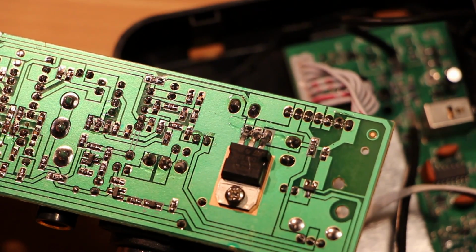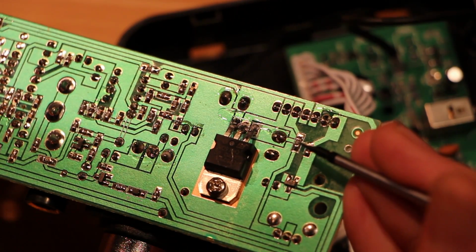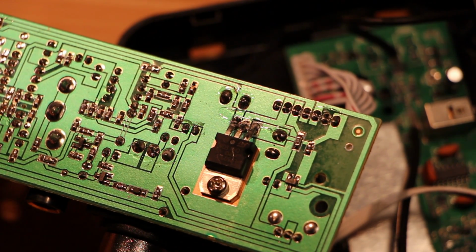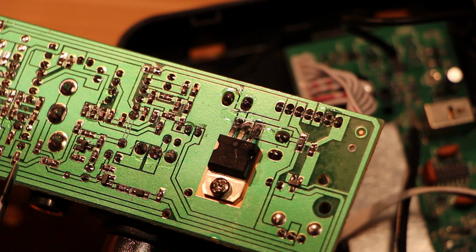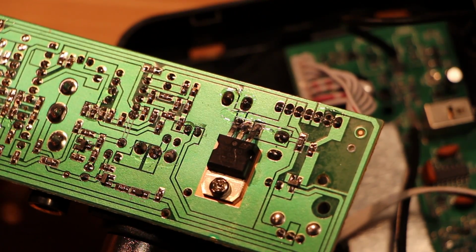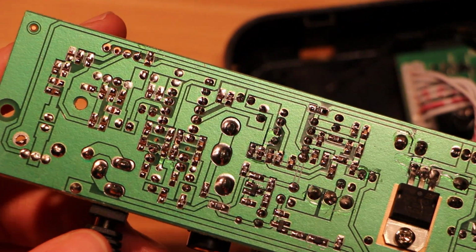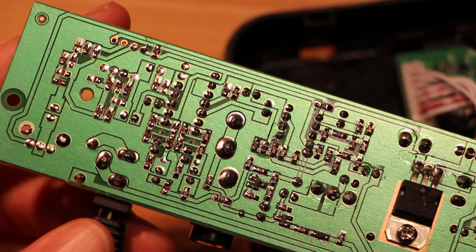Oh, you see that? We're using a 0 ohm surface mount resistor just as a jumper right there. Yeah, there's a couple of those on the board. Here's another one, just so they don't need another layer. This was enough. Alright, that was something I was curious about.